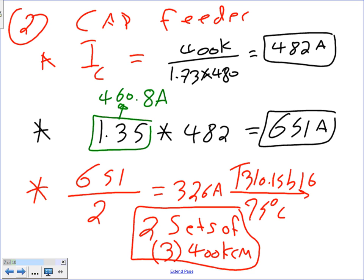Any question? If we derive the answer from real math rather than the table, is that all right? That's fine. Do you end up with the same answer or different? Quite a bit lower. Which one is lower? The cap needed, because I calculated based on the farad value of the capacitor in order to derive the... I wouldn't use farad. I've never seen a capacitor sized that way. Never worked in the power industry then. If you worked in the power industry, you probably have seen it. They have a farad value, but we size them based on kVAR.